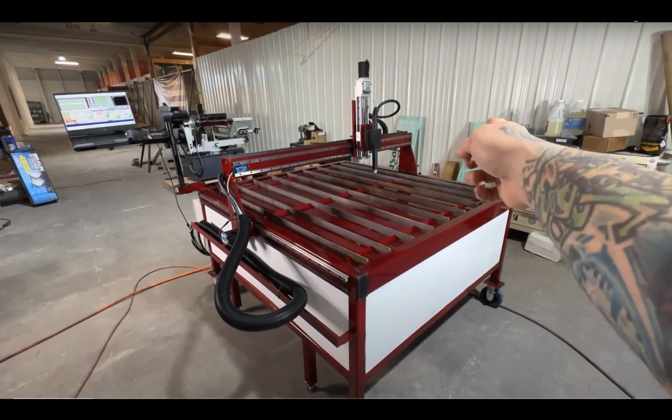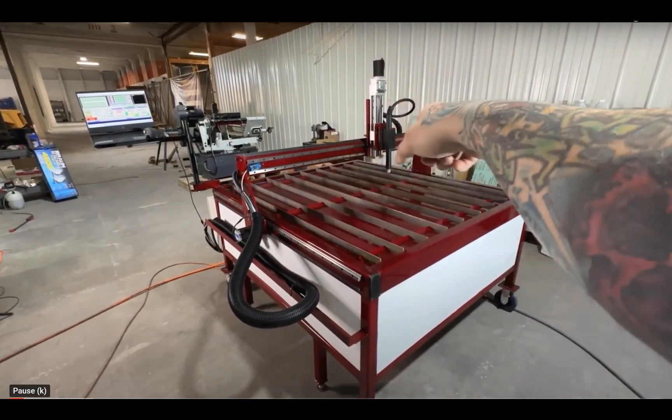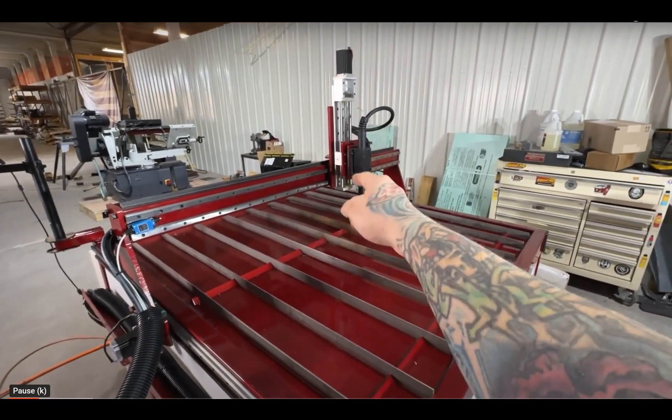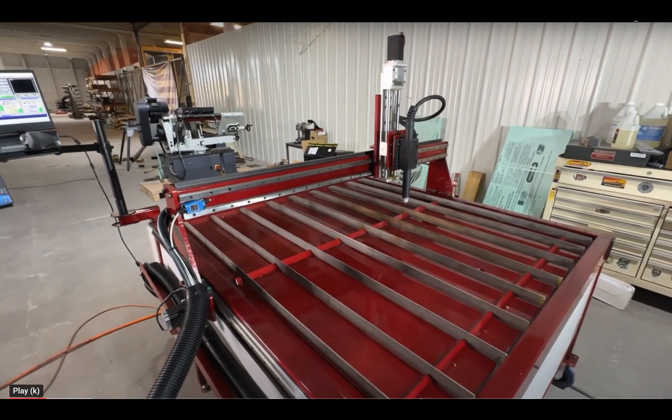This is his brand new four-foot by four-foot CNC plasma table — actually four and a half feet one way and almost five feet the other, so you can cut a true four-foot square inside. It has the Z touch probe, so when it comes down it touches off to the part every time for an accurate cut. I want you guys to look for a ground bus bar or any grounding on this table that would indicate he understands what's required.